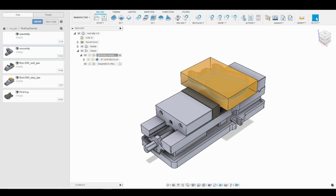There are a couple interesting facts about 3D toolpaths and about adaptive clearing. The interesting fact about the 3D toolpaths is Fusion 360 will consider the geometry of our model for us when we go into a 3D toolpath. The interesting fact about the adaptive clearing strategy is that Fusion 360 will try to keep an optimal load or constant engagement of our tool with the material. That allows us to optimize our speeds and feeds, and we don't run into any scenarios where if we take a corner, we would potentially take off more material than what we were expecting. Fusion will do the math for us and make sure that our tool stays within that optimal load.